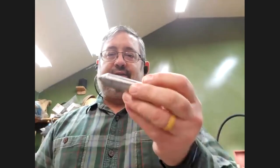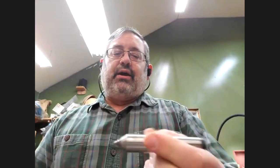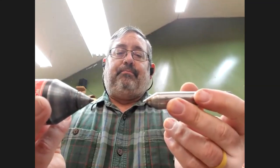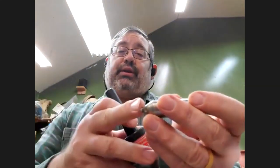You can also get rid of the mandrel completely and turn between centers. You glue up your blank, put this — actually a dead center for a tailstock — into your headstock, and put the blank between this and your 60-degree live center.